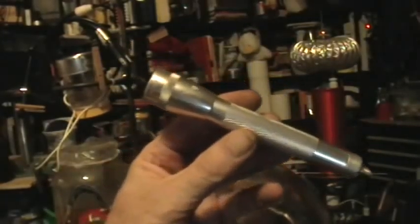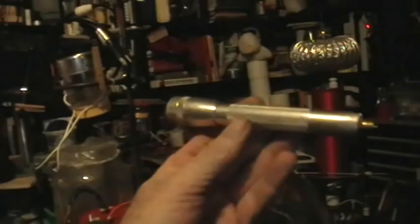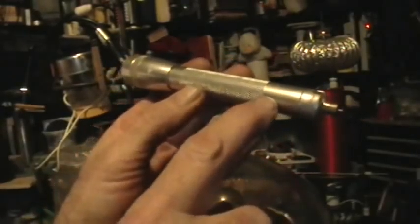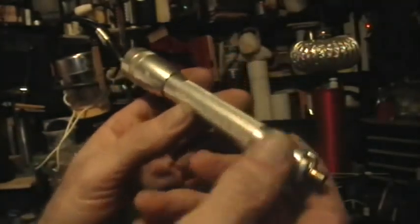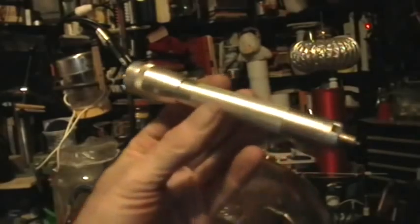Now, I just used the plastic tube and the 6mm caliber because I wanted to see if it would work like that. If I used a .177 BB caliber, which I think is a 4.5mm tube, then I would put a little magnet in there to hold a BB in place, right? So that you could pump it up, drop the BB in there, and it would stick where the magnet is until you actually fired it. That would mean it wouldn't fall out if you had to aim it downward, okay?